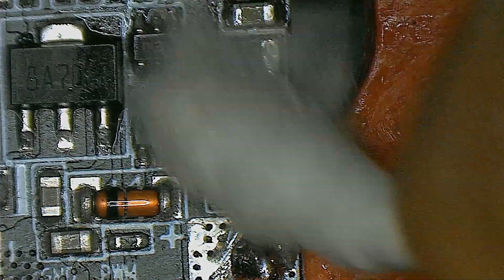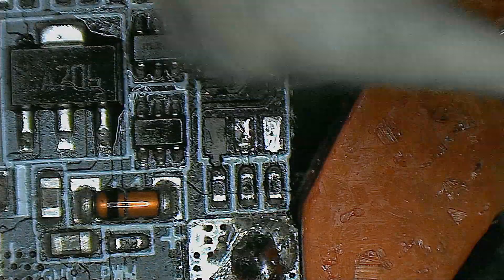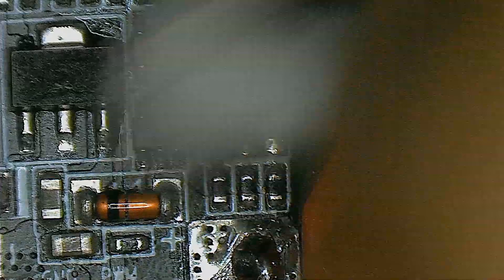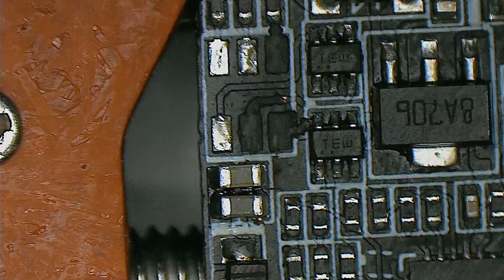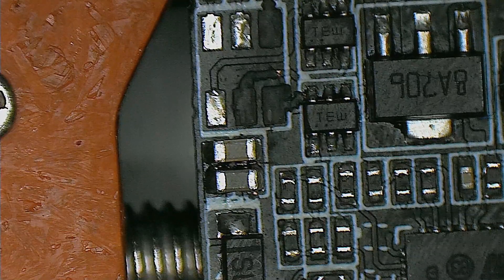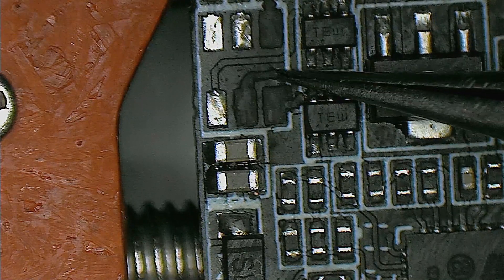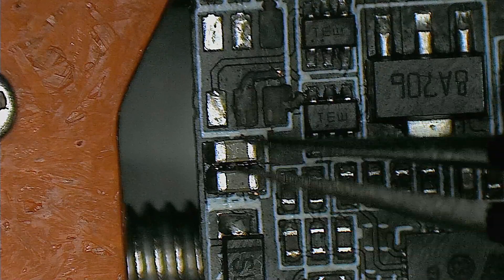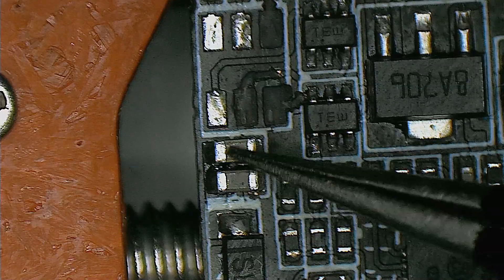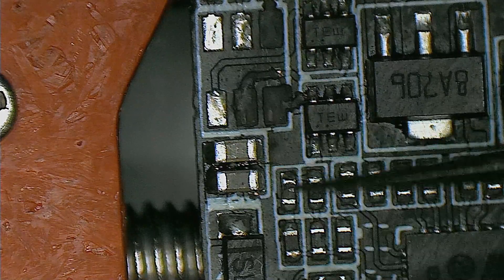Taking the Q-tip and cleaning here thoroughly, hopefully cleaning these caps too so they will look shiny again. After the Q-tip I will spray some alcohol and use a toothbrush to clean even more. The Q-tip is very nice because it drags the dirt and mess onto the cotton. So now more alcohol — and we fixed our two little missing caps. This diode was not properly soldered down. I cut out this little piece that was flimsy — we don't need those pads so we are safe. We took these two caps from the donor and soldered them here. I decided to use the soldering iron, but you could have done it with hot air; I just wanted to limit the hot air going here.